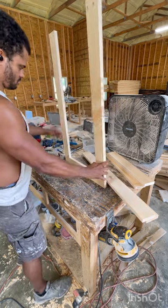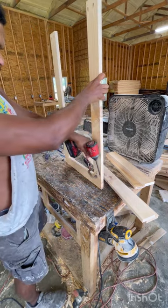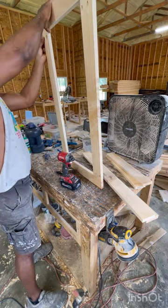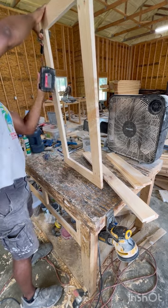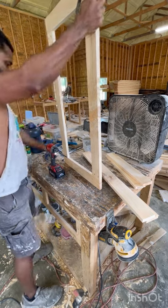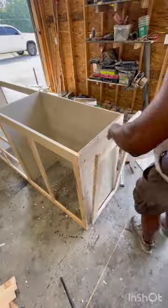From there, this is me doing the trim on the very outside of the bookshelf. I usually use one-by-ten pines and I'll strip them into one-by-threes — I've kind of realized that comes out to be about the best-looking trim I can get out of it. More pocket holes, more clamps, and sometimes on the base I'll use a little bit of glue.